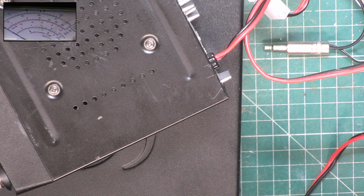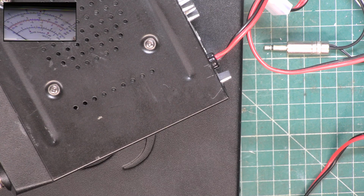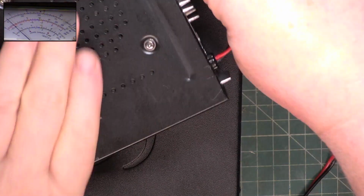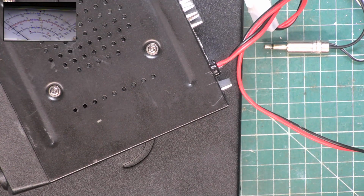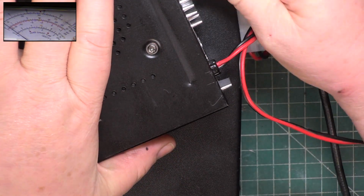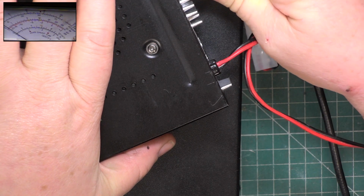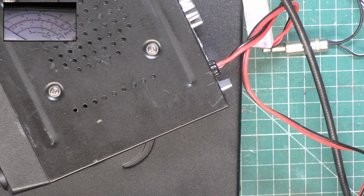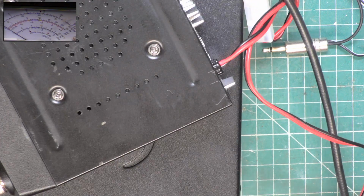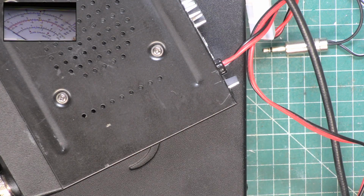So what I'm now going to do is I've got this Cobra 29 underneath. So first of all, I'm going to put the base station on. We'll now swap the aerial for test equipment to the actual aerial. I'm going to talk on here, and then we're going to talk on the Cobra. I want to hear what the two sound like. I've no idea how this Cobra is set up, but it's a radio that I set up whenever, I did the video on it. So I know it was right. And we'll see what the volume difference is without changing the volume on the base station.